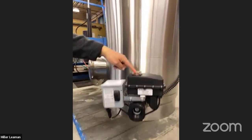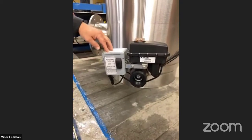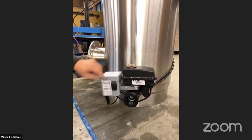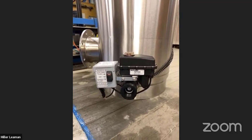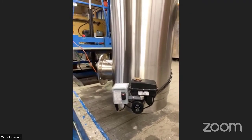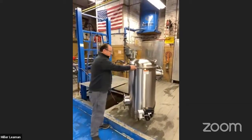You have an indicator showing off and open positions. This little box contains a timer that can be set - it's factory set to once every 24 hours for 8 seconds to flush. To activate that, you click it on auto timer flush, leave it there, and once every 24 hours for 8 seconds it'll flush itself. That's user-friendly and adjustable - if you want to flush every 48 hours, 64 hours, or 8 hours, whatever you'd like, you can do that.